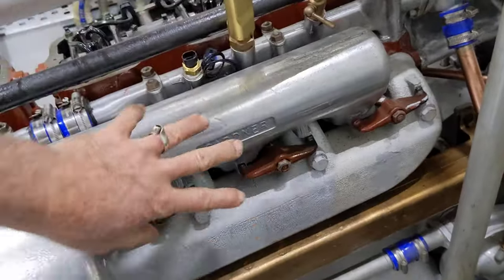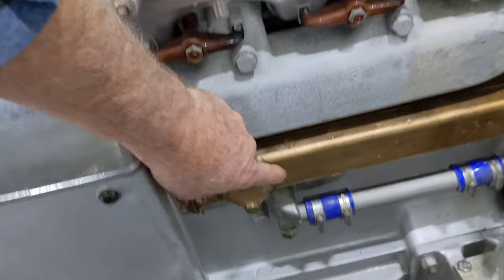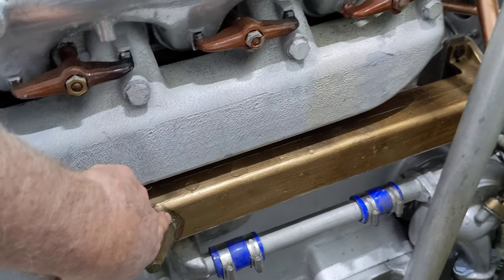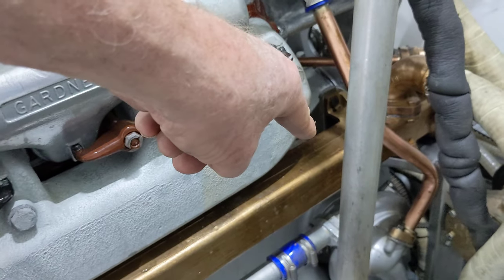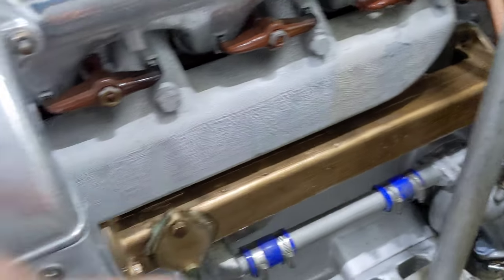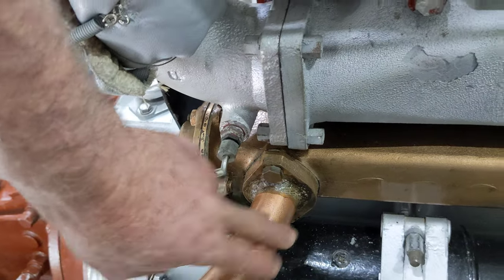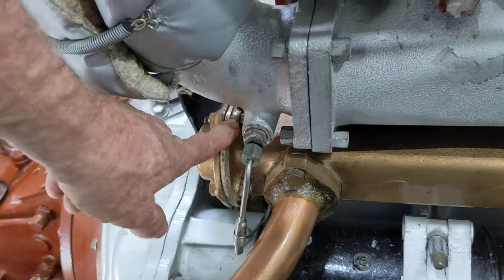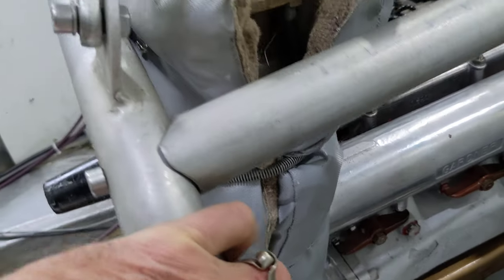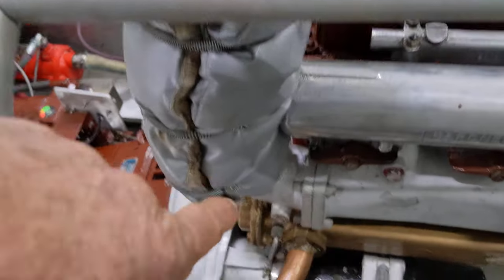On this side of the engine we've got the intake manifold and the exhaust manifold, and this is the oil cooler. We take oil with its own oil pump and system, oil gets sent into the center of the tube here, salt water gets fed into the outside of it, and then both flow down here — not together of course, they're separate. Water comes out here and goes back out, the oil comes out and goes back into the engine oil sump having been nicely cooled down.